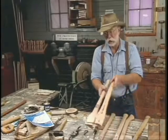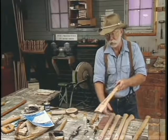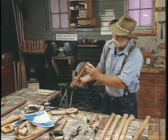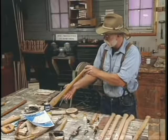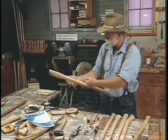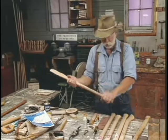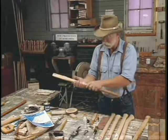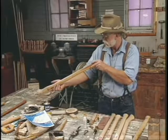This on the other hand is also a 28 inch double bit handle. And if you can see, the grain runs the wrong way on it. Now if you picture this with percussion, with the grain running that way it's going to pop it loose under pressure. This doesn't have a good feel to it. It's also got a shellac on it instead of a wax like the link handle.